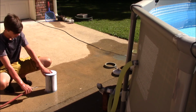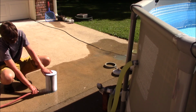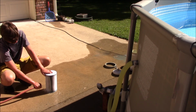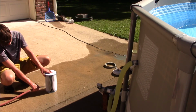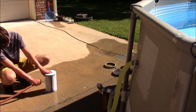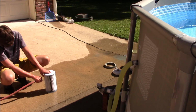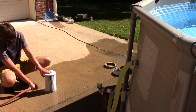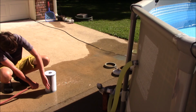Next year my goal is 3 parts per million all the time. Which is pretty high, but you want the chlorine to be pretty high so that the pool won't bounce into a really trashy state as soon as anyone swims in it, which is what it does currently. And it takes several days, if not a week, to revert the pool back to a super duper clean state, which is what it's in right now.